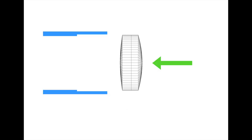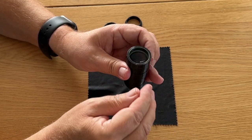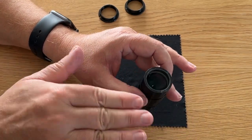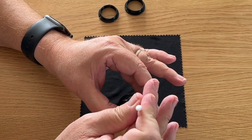Here is the collimator lens seen in profile. Notice that the radii of curvature are different between the two faces, that the thickness of glass at the edges are also different, and that the lens must be inserted in the collimator tube in the direction indicated by the arrow. We mount the lens in the collimator tube — it must slide easily without effort, in a soft way. We tap it so that it falls on the shoulder where it rests. If there are no burrs, it glides smoothly. Check this point. Be careful that it does not mount crooked.